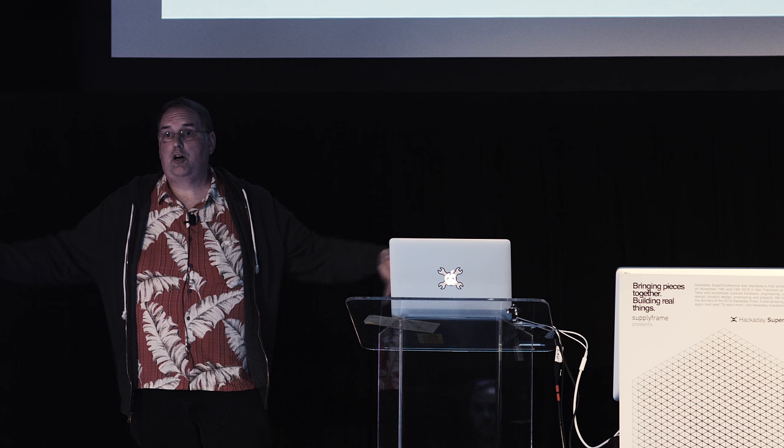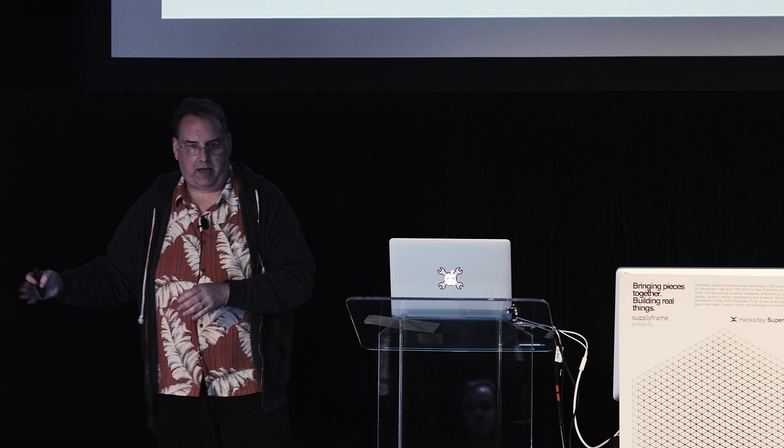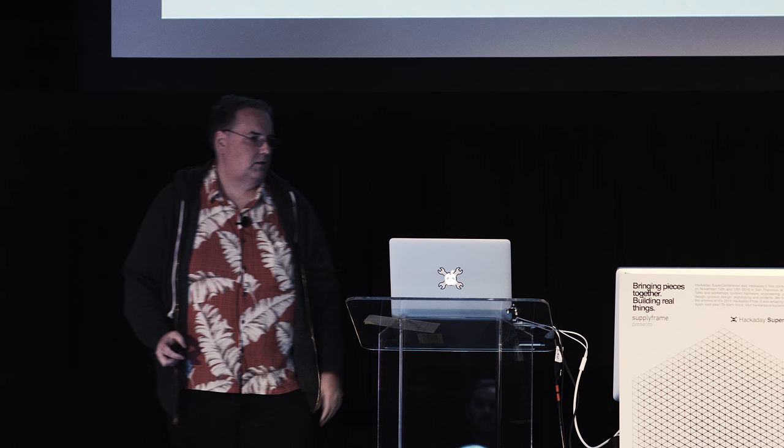have to do your assembly in two passes. He'll have to load a set of reels on the machine, place a whole bunch of panels, set them aside, then change out all the reels, reload the programming in his pick-and-place machine, run the boards through again, and then bake them. And he will charge you for that, believe me. So, what does that mean? What can you do about that?